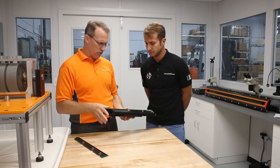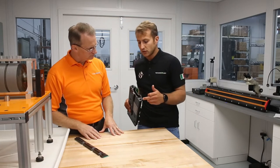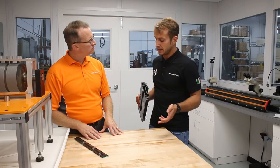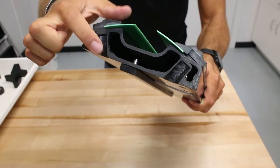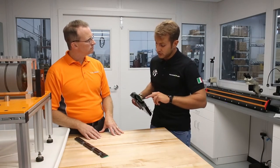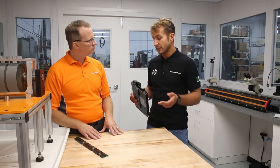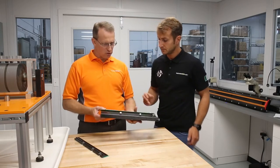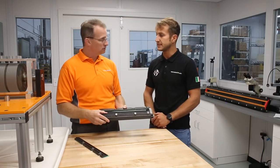Tell me more about your actual profile and how you secure the pins to the body of the chamber. We make the profile with 100% carbon fiber. All the profile is made from molding, and the housing of spring-loaded pins is derived from the molding itself. It is an integral part of the surface of the cavity, which gives a lot of stability and avoids any kind of vibration. This technology is designed and patented by Packaging Class. That's a patented technology that makes it more secure and more durable over the life of the product.